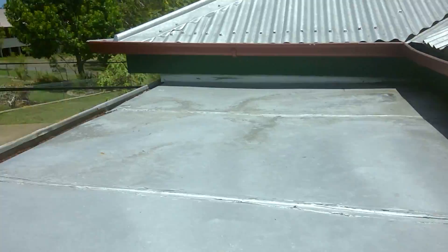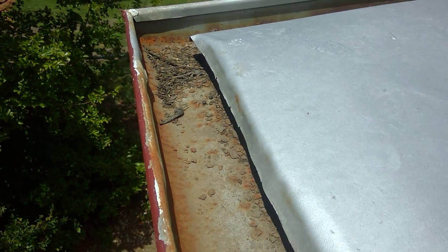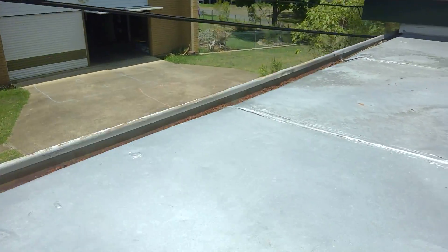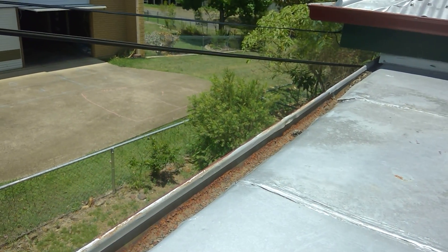No doubt there is some corrosion — I can see some penetrating through. The gutters in some areas are original. You can see the rust above the front entrance, and it's quite bad over there. The flat tray roofing above the front entrance is original and you've got some deterioration consistent with the age. The fascias and normal stuff like that — so you're going to have to keep your eye on the roof. The gutters may not last much longer.